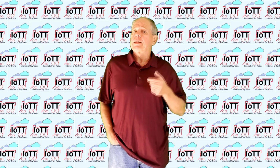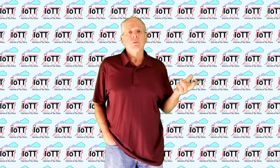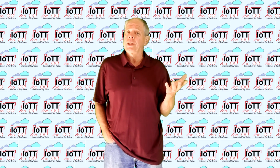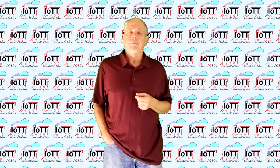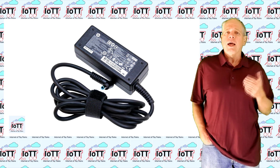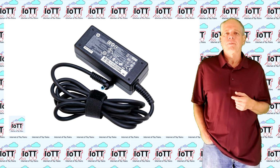So, with all that in mind, what power supplies are suited best for a DCC layout and what would I recommend? And once installed, is there a good way to test the proper functioning of the power supply and the protection functions? In my experience, it is best to use a regulated power supply with a nominal output current higher than the current ratings of the connected booster or command station.